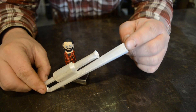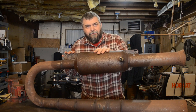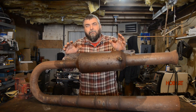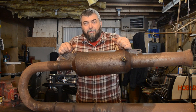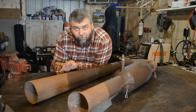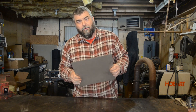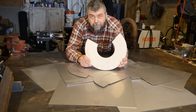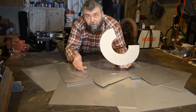It's about seven foot long, maybe a little bit longer. Typically you're going to find plans for an engine like this — this is a 55-pound Hiller Lockwood valveless pulse jet engine that puts out about 55 pounds of thrust. Well, we just need more teeth-rattling power than this. Now this engine is made out of just mild steel, and that works well enough, but stainless is really the way to go for longevity. These are all the 304 stainless flat blanks to make this engine. Once rolled together they'll make cones, and once we put all those cones together we'll have our pulse jet engine.